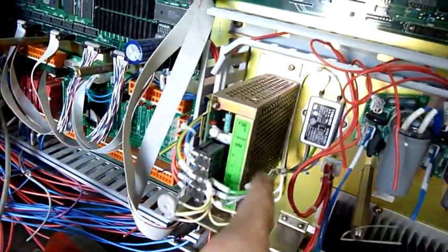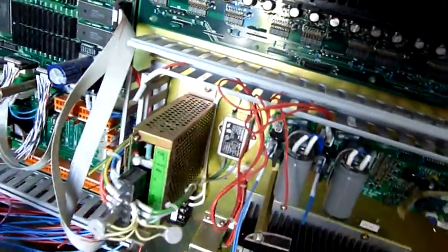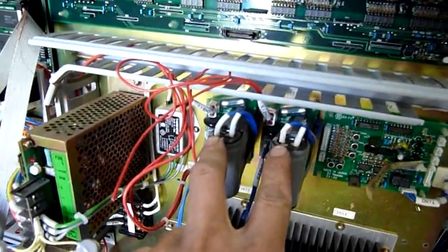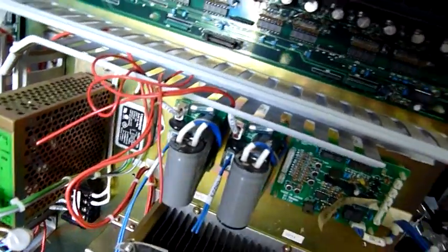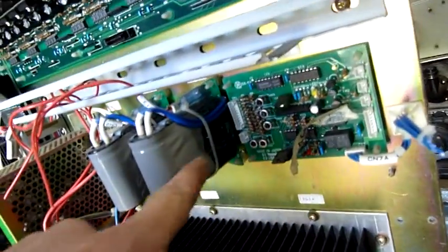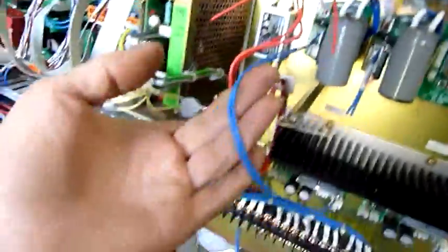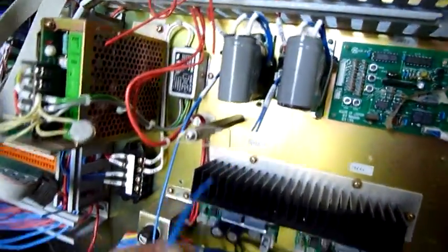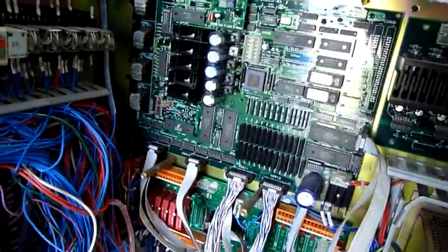Another one of those 100 volt in, 5 and 12 volt output switch-mode mini power supplies. Mains noise filter — 240 in, 240 out. Those 240 volt DC supplies are probably 260 by the time they go through. There's a bridge rectifier, what looks like a metal oxide varistor (MOV), a fuse, and a bunch of 270 microfarad 400 volt DC Nichicon caps — three on each one. There was a little buzzer on there which I pulled off — it's a repeating beep-beep-beep type buzzer.